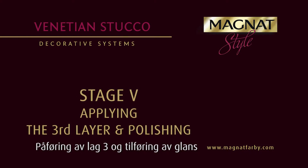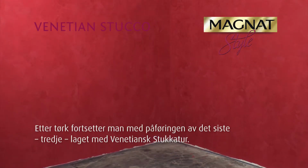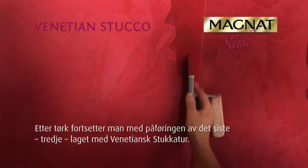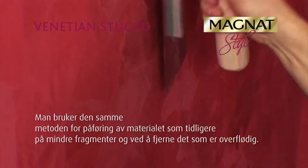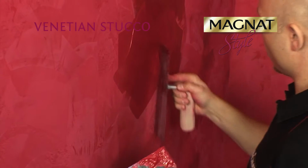Applying the third layer and polishing. Once the coat has dried, apply the final third layer of the Venetian stucco. Use the previous technique to apply the product in small patches, always removing an excess of the material.